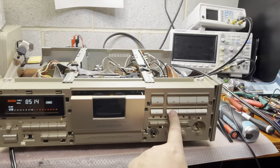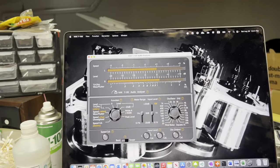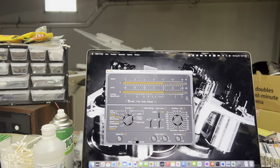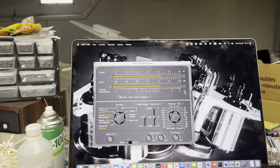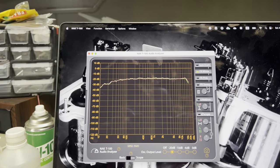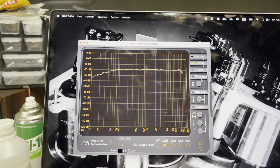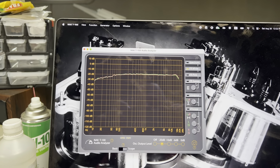Let me see. Let me start recording. So here 12 kilohertz, so it keeps. So this tape, perfect. And 400 hertz, it keeps it perfect. And now we see that this records on normal tape up to 17.5 kilohertz perfectly well, with good balance between left and right channel.